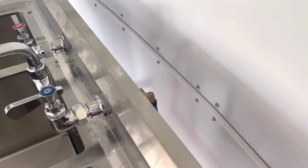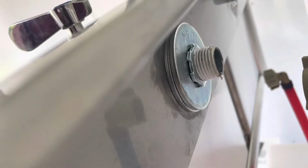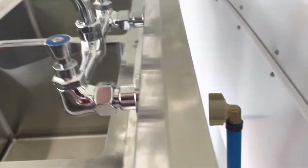Okay guys, just a real quick update. We changed the plan a little bit. So what I had to do was actually add 2 of those 7/8 washers on the back. What happened was the nipples that I had used originally, I think they were just a little short. So the PEX fitting wasn't grabbing enough thread because it is leaking when I just did that test.